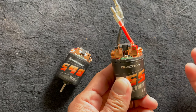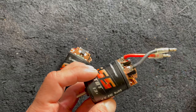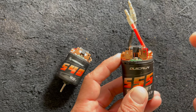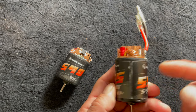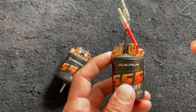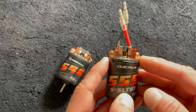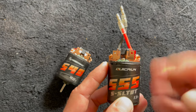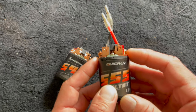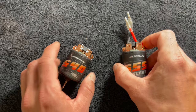Another point is the brushes — we did some development on the brushes themselves. If you've only ever run brushless motors, a brush motor takes normal DC power in through the wires, which passes through the brushes onto the commutator inside. The commutator has segments that go to the coils of the motor, the can has the magnets, and the motor itself takes care of commutation to make it rotate. Those brushes wear down over time, getting shorter with use and building up carbon inside. The engineering focus was on a very long-lasting, high-performance brush.